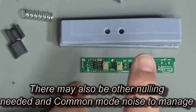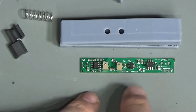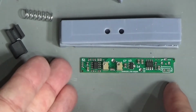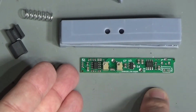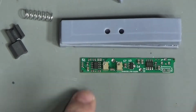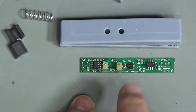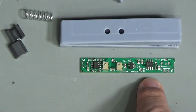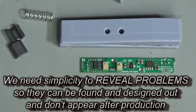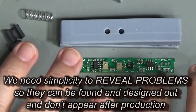So you just press a little button for a couple of seconds, it zeros, holds that, and then you can make your measurements. But that would detract from the core circuit. This is a prototype. Don't want complexity and things like that detracting from the core circuit. This is an amplifier, an offset adjustment, a second amplifier, a regulator, and this is a voltage divider that creates a plus minus 6 volt supply. And that's it. That's all that's on that board. Don't want any more complexity than that.